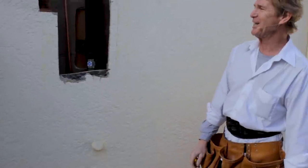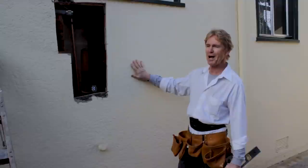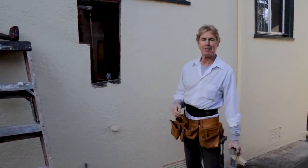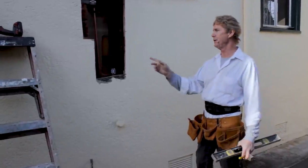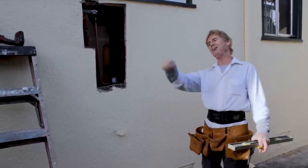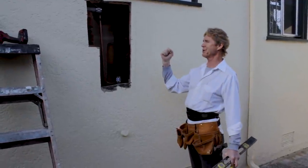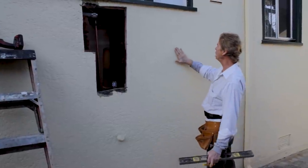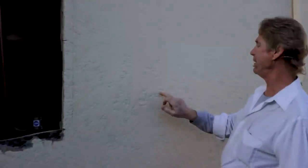More importantly, anybody know what kind of finish this is? This is a knockdown dash. How do you match a knockdown dash? After you do the two coats, you mix some soupy cement — like the old saying in the 1800s, 'dash a dash of salt in your food.' You take that mud after the two coats are on the base coat and fling it or dash it on, so it looks like mountains and valleys. Then you take a trowel and knock it down — that's why you have smooth stuff here and valleys there. We'll show it step by step so if you have plumbing repairs, you'll know how to fix it yourself.